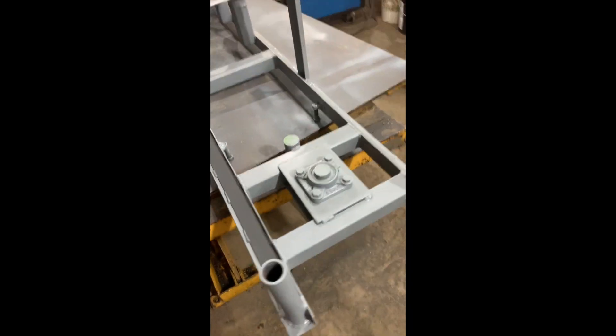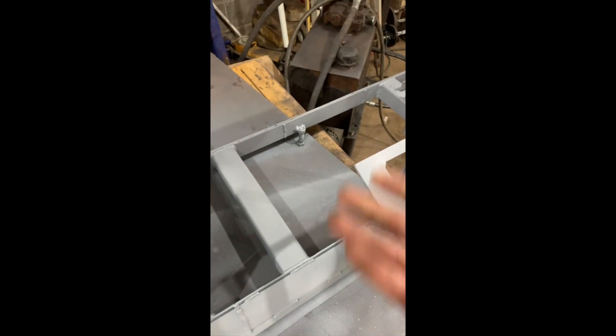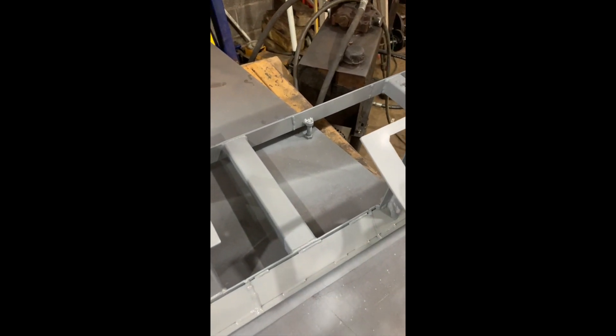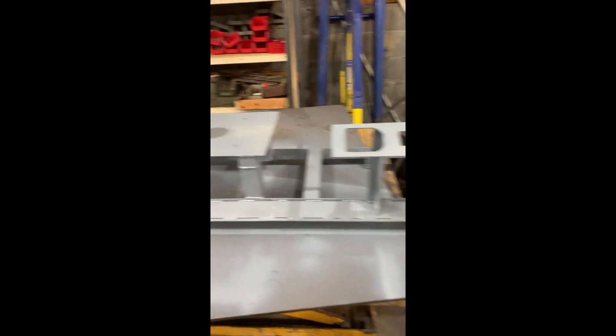I had to change the feet mounts too. I should have really put a nut on and welded it where the feet holes were, but I wasn't thinking about that at the time. So I went ahead and welded a nut on the inside of the channel. Right now I just have screws sitting in there so I don't get paint all over everything, but these are the feet that'll screw up inside there, and the nuts are up off the plate so they won't interfere with milling.